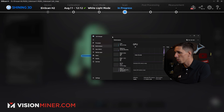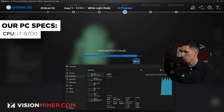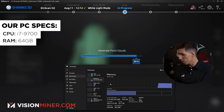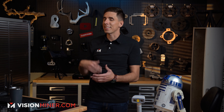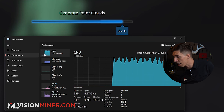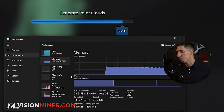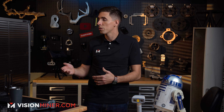In case you're wondering about what kind of computer you need, we're using an i7-9700 from about four and a half years ago — 2018 — and 64 gigs of RAM, using about 28 to 29 gigs. Our NVIDIA GeForce RTX 2070 is doing just fine. The GPU and graphics card really come into play at the end when we mesh the file. The CPU is pegging out — that is processing the point cloud data. RAM more so determines how much data you can process. I would opt for at least 32 gigs; that's really going to help, especially with the H2 and the higher resolution color texture. It's a lot of data.